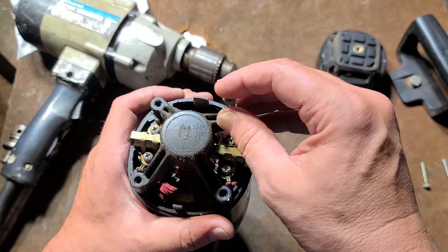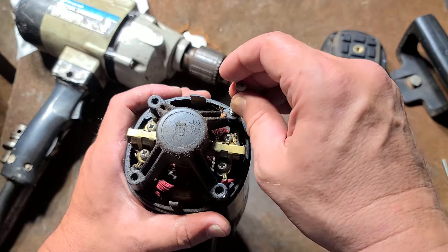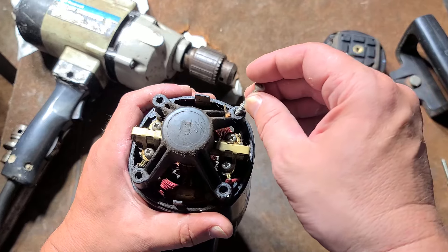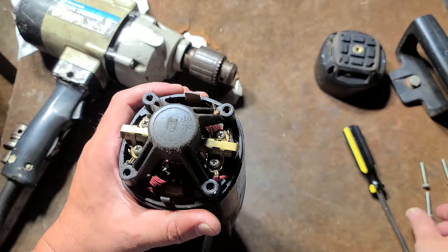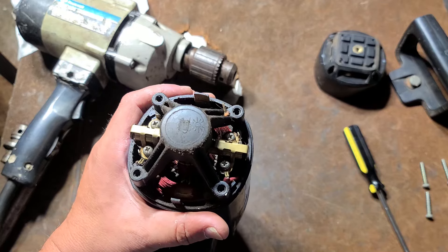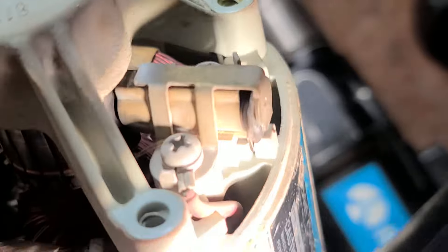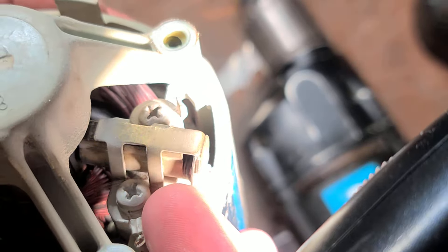These plastite screws have a deep track and a shallow track, and if you pull them out and screw them back in there'll be two positions — one for the original threading and one basically 180 degrees out. If you get them in the wrong position it tries to run the deep thread in the already existing narrow groove and the screws end up being really stiff and difficult. Taking a quick look at the backs — the brushes are the same on both of them. They have pretty decent brass brush holders with a clamp and that's where the conductor comes in, held with one of the screws.